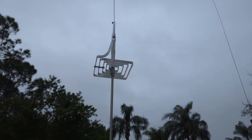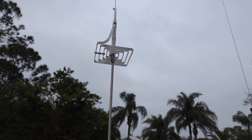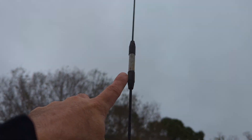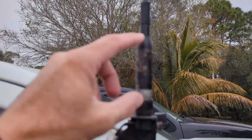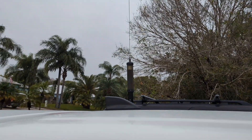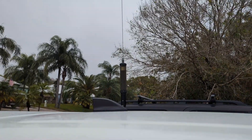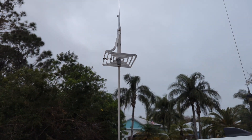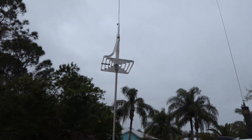Open that K40 up and look inside — you're going to see itty-bitty tiny 38-gauge magnet wire wrapped around a little plastic piece. I've smoked many of those with less than 200 watts. They're not made the way they used to be. There's no real magnet wire tiny little coil wire in something like this. The Tar Heel over there will handle about 400 watts due to the size of the coil.